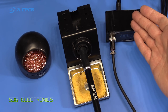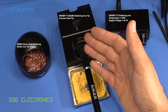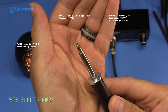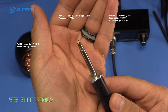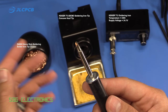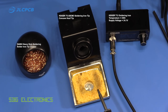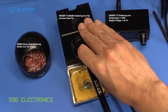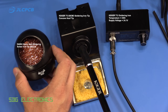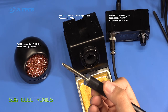The KSGER T12 is a really nice unit — really low cost with excellent performance. The really nice thing is that you can buy a wide range of soldering tips for a really low price. The one we're going to be using for this video is the concave hoof shaped tip. The nice thing about this is you can hold a nice little ball of solder in the tip, and when you do the drag soldering it keeps some solder there and stops you leaving too much excess solder on the pins, so we should get fairly decent results. For cleaning the tip we've got a damp sponge and also a wire wool container from Banggood — really low cost and a really nice form factor for cleaning oxides off the tip.